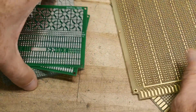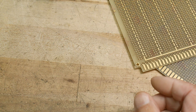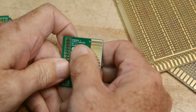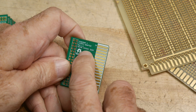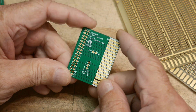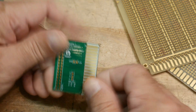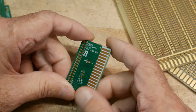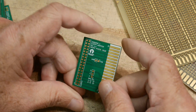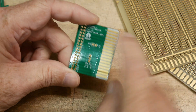I just got a PC board yesterday that's part of my Osborne project, and I didn't want to devote an entire video to it so I'm throwing it in here. These are little boards I had built - this is not my design. It came from Wayne Visser (V-I-S-S-E-R), who designed this and put it up on a shared site. It was designed in KiCad. He did not have any Gerber files - just the actual KiCad design file - so I had to fire up KiCad, develop Gerbers, and then have them built.